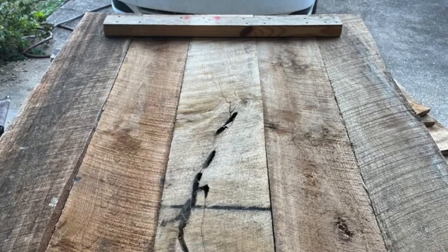The plan was to sand down the original tabletop, but there was a veneer coating on top of the table that just would not come up. It was bubbled up in spots, and I decided to build my own tabletop with the help of my dad and my husband. So we removed the legs from the tabletop, and we had some old barn wood laying around my parents' farm. So I picked out a couple pieces that I liked. We cut them down to size. We just measured out the original tabletop and cut the barn wood to match the same size.